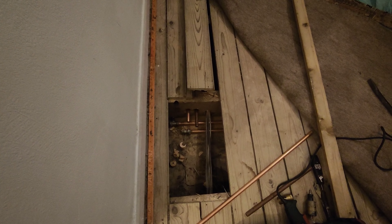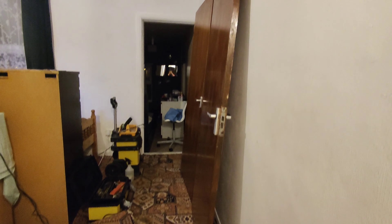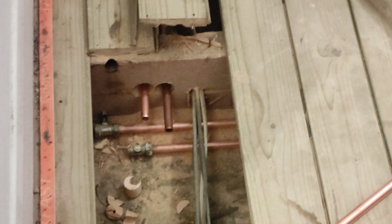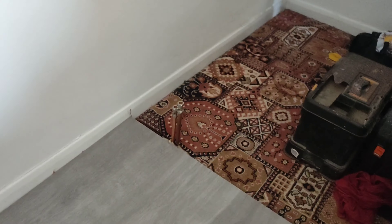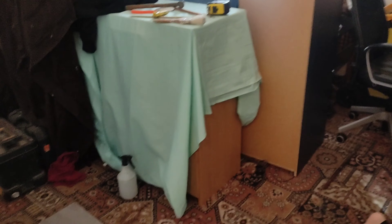I added a couple of sections on there for a couple of feet. This is for the toilet - hot and cold water. At the opposite end of the room I'm going to add a 90-degree join and I'll have a partition here, so there'll be an alleyway for the small room. I had to drill through the beams to take the water through. I drilled through a little bit lower - obviously if you screw through the floorboard you don't want to hit your pipes, so make sure you're under the floorboards by at least two or three inches if you've got enough beam.